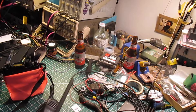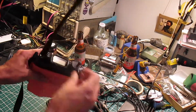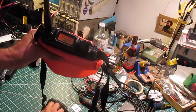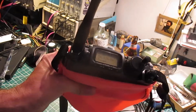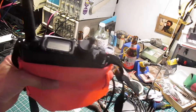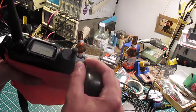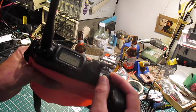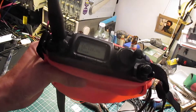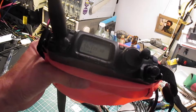How do I know the SWR is bad? I'll take my Yaesu radio over here, plug the antenna into the front, turn it on to 50.125, and then make a call out and watch the SWR meter. As you can see, the SWR meter was probably somewhere around 5 bars or something like that. We'll just try to see that SWR meter a little bit better.